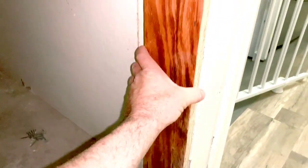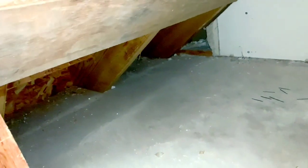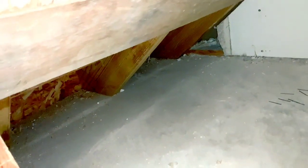As you can see, it's coming along. You have to put the framing right here — pieces of wood right here — so that way I can put the crown molding on the edge. I cover it with a piece of wood right here, and I'm almost done with the walls. I'm going to put two small pieces of 2x4s and then seal it up right there. We're getting there.